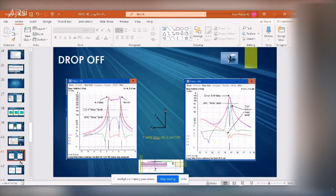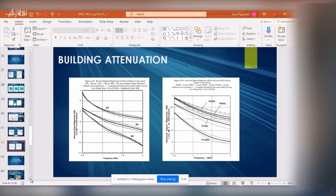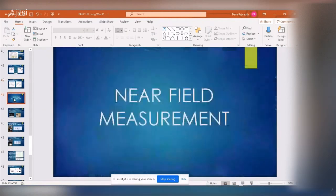Once I mount the antenna against the side of my house, in addition to that sharp drop-off I'll also get attenuation from building materials. NIST publishes attenuation charts, but unfortunately only from 500 MHz to 2 GHz — not covering HF. However, at 500 MHz there is measured attenuation for brick, so at HF there will be some attenuation — certainly not zero. Plywood shows much smaller attenuation. Each line on those charts represents a different material thickness, so I'll get some benefit from the building materials.